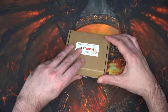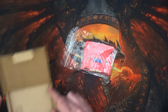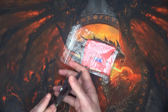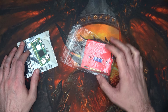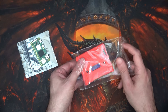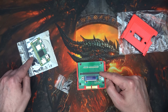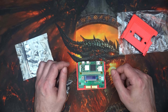You need to install a Raspberry Pi. The Raspberry Pi they recommend for this particular design is a Raspberry Pi Zero 2 or a 2W. I happen to have a 2W — I've forgotten what the project was that I bought it for back in March, but it's been sat around doing nothing ever since. You'll notice it doesn't have the pins installed and soldered in. For this design they've already got the pins there on the board, so you don't want pins already soldered on. You want one without the pins, then stick it on, solder it in, job's a good'un.